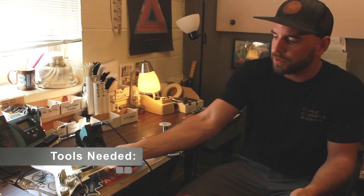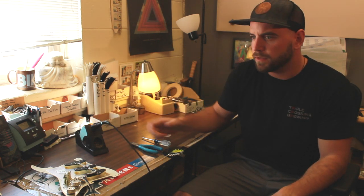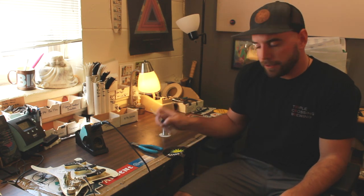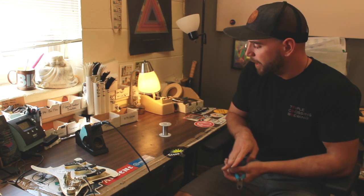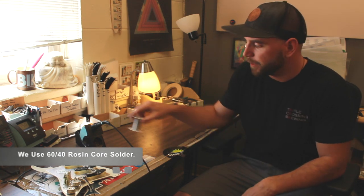You're going to need a few tools to perform that. A soldering pencil is definitely what you need — we don't like soldering guns because they will demagnetize pickups and they're just unwieldy. We use soldering pencils; it's a little bit easier to work with. Also a screwdriver, a pair of snips, and some good quality solder. We use lead-based solder.